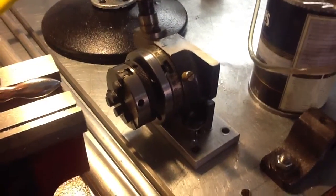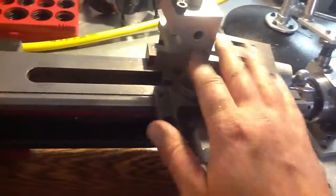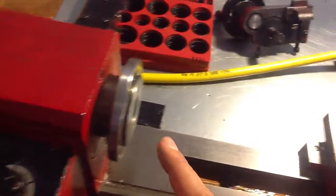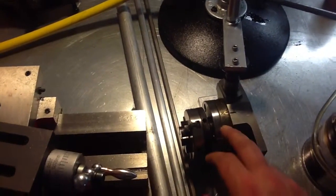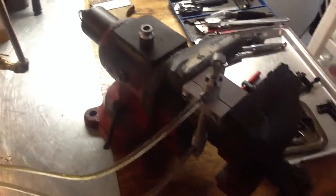I had picked up one of these — I think I got this on eBay. This is a small rotary table that I picked up on eBay, actually had it shipped over here from India. It was pretty inexpensive but it's a nice little rotary table. I built this block that I can use to affix it to the cross slide. So you take this whole thing off, put that up over here, get the end mill in the spindle, and you can use it to mill your radius. That's actually what I built this stock for — to bolt the stock onto the rotary table, bolt that thing onto here, get it positioned, and turn it to mill that radius on there. That was how I milled these radiuses here and here to build these nice little pieces to connect the thing to other things.